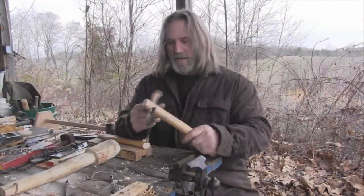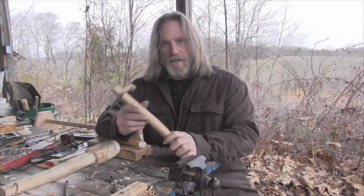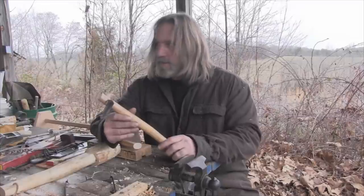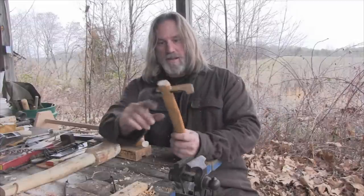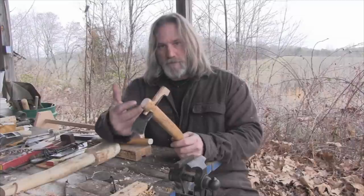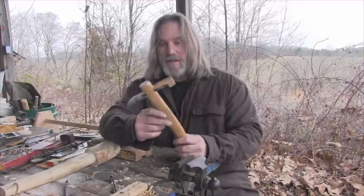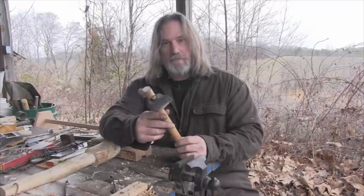Like I said, this is not the final rendition of the tool — I've still got to sharpen the blade and temper it by drawing some of the hardness out of the metal from the initial heat treat. But you get the idea of how the tool is set up and how it works. It was made with a horseshoe rasp, so if you can blacksmith and do metal work and woodwork, you can make a lot of things you may need.